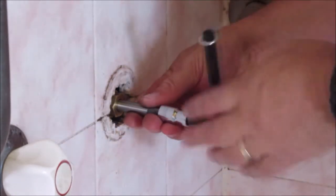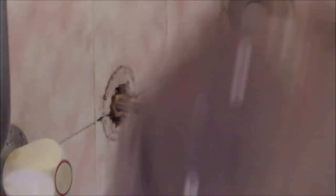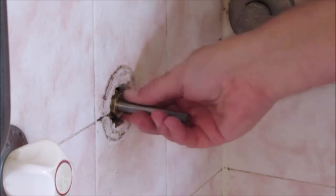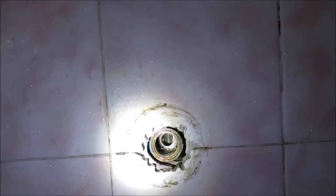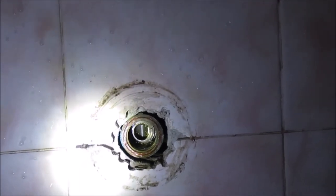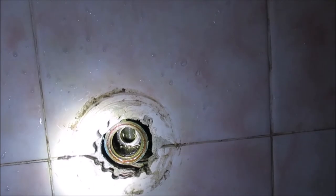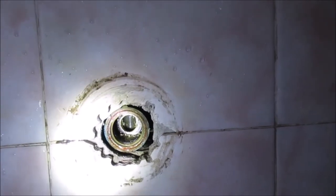I'm going to take that out because it felt like it went home. Thankfully I put the plug down there - this is my own advice. So hopefully we can get on camera - you can see the new thread that's been cut in there. You can see all the shavings that are left in there, so I'll get a bit of paper towel and wipe that out, clean it up, have another look at it, and then we should be right to screw everything back in and put it back together.